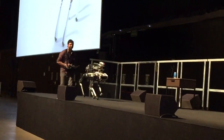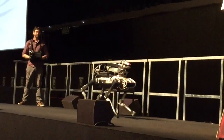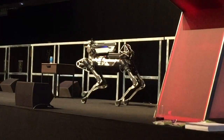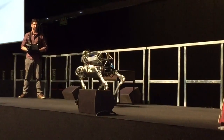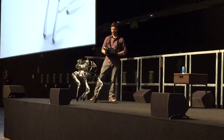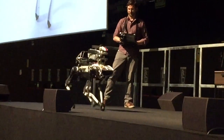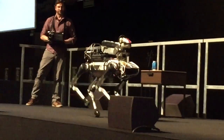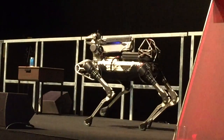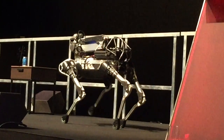The controller is giving commands and all the computing is being done on the i7s on the robot. It's walking with a crawl gait where it uses one leg at a time. All Seth is doing is giving it forward speed, turning, and lateral speed, plus some buttons to make it do special things. Now he's going with a trotting gait, which is diagonal pairs. That's a pacing gait, which is lateral pairs. The robot switches between those things — Seth doesn't have to do anything; he asks for the new gait but the robot coordinates that motion.